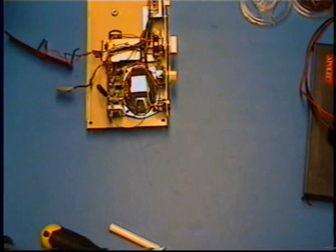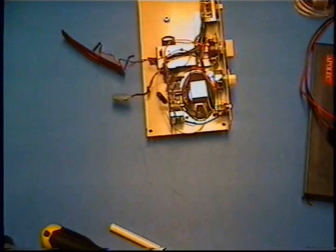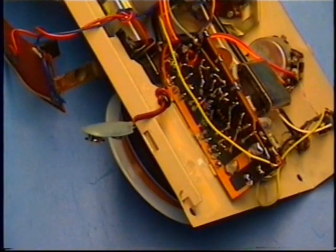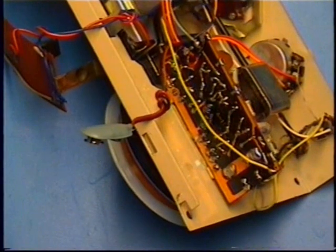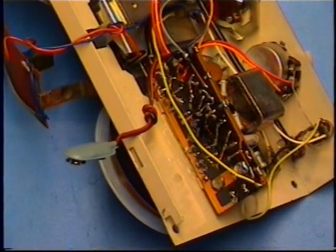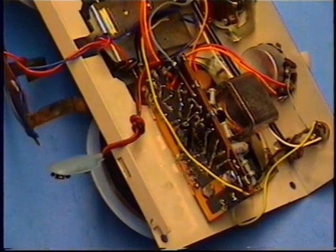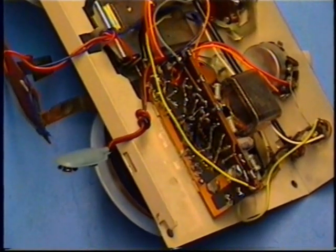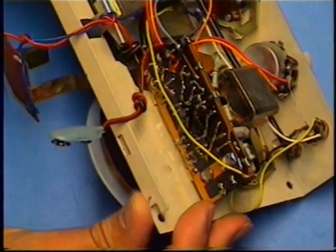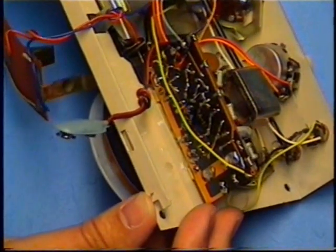So I had to take the motor apart and manage to use some super glue and manage to actually repair the motor. And it's working again. Thank goodness. A little bit more noisy, but it works. It was the little commutator pieces that the brushes go against. They were glued onto the shaft or a thing on the shaft, and all three of them had come off. Oh, fuck. So I had to glue them back on very carefully, and then solder one of the little coil wires back on because one of the little enamel-coated wires had also broken off.